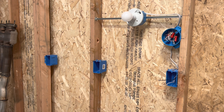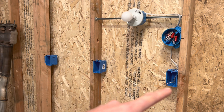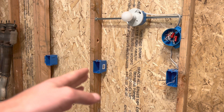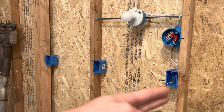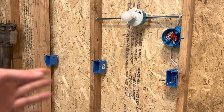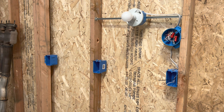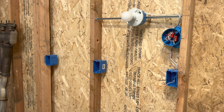Like always, you're going to need a power on one side and a switch leg on the other side. Most people put the four-way in the middle, but if you really wanted to put the four-way at the end or something, then you could do that. But really, they're all the same switch — it just interrupts it. So however you want to wire it, the easiest way is just put the four-way right in the middle.